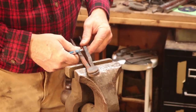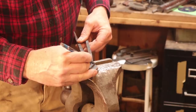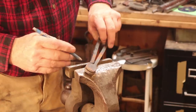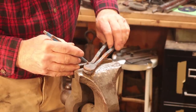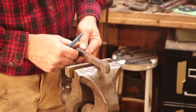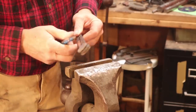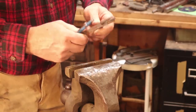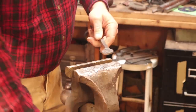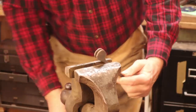If I look at these and see where it's hanging up, I can tell it's hanging up right there in that corner, so I'm going to need to knock that corner off on both sides of this outer head. That might be all I have to do to get these to work right. I wouldn't mind cleaning up the inside of the notch just to make it look a little bit better, but I don't want to make them loose and sloppy — although we can always go back to the forge and fix that if we do.